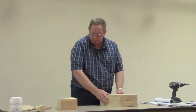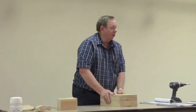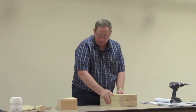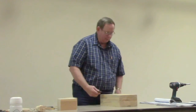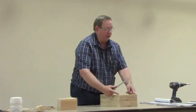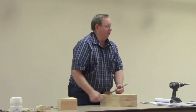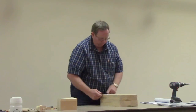I like to square it up because as I lay my pattern on here, I'd like to chase a lot of the lines around the block. The more accurate you are, the more it's going to reflect accuracy as you work through things. It may not necessarily be absolutely square, but say you're not exactly parallel, say maybe you're 7 15/16 and 8 1/8. Is that a deal breaker? Probably not, because it's going to take a lot of time to plane that down and get it flat. But the other thing is, always measure from the same side of the block. If you're 4 inches here, make sure you're 4 inches here and chase around that way.